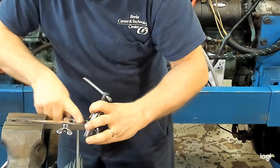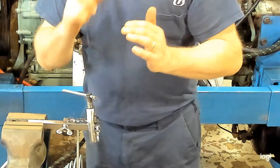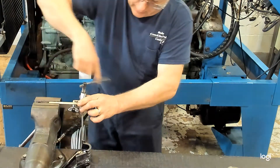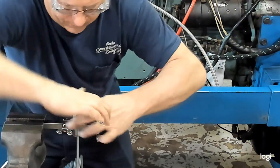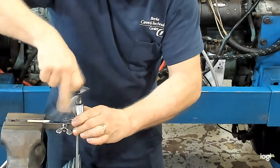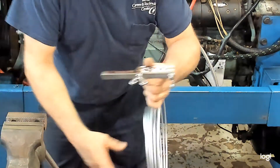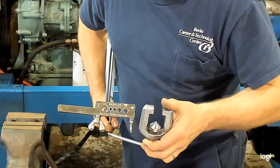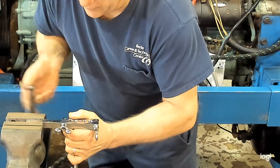Back it off. Now the top of that tubing has been taken and bulged out — almost like that bubble flare we talked about earlier — but that's only the first step for the 45 degree double flare. We're now going to take the pressing tool without the quarter inch button and we're going to finish it off — we're going to fold it in on itself. Square it up, tighten it once again with moderate pressure, then back it off. You can see there's a nice shiny seat at 45 degrees made by the cone or taper on the pressing tool. That has finished off the flare and folded it in on itself — that's what we're looking for. Take it out of the splitter.